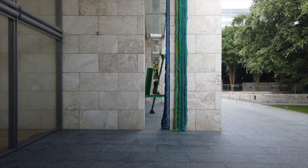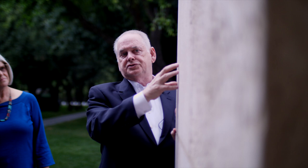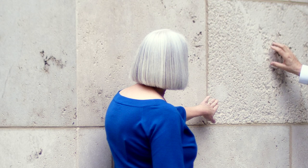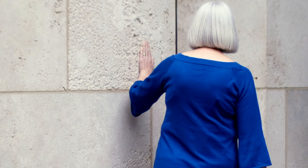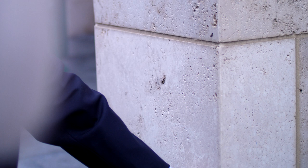This was cut — think of it like a wedding cake — parallel with the rift, which is the layers of the stone. Then it goes through a very intense water-blasting operation which gives all these little specks, and basically erodes down into the tidal pools that have been set in over the life of the stone. If we look here, you can see this piece is a match to this piece here.